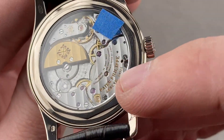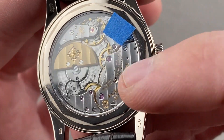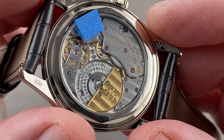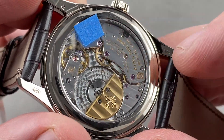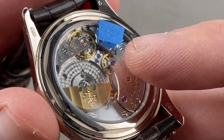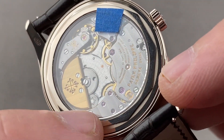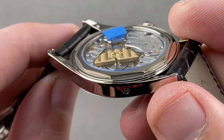This version features the Patek Philippe seal. From mid-2009 onward they would have featured the Patek Philippe seal; prior to that they would have had the Geneva hallmark. It's a 27-jewel movement, all of this 30 meters water resistant, nicely decked out in a combination of engine turning in two sizes on the base plate, Côtes de Genève across the rotor and the bridges, mirrored perlage which you can see lighting up underneath my finger, beveled edges on the bridges — the same mirrored treatment given to the jewel and screw sinks. All screw heads have been chamfered on their slot and around their circumference. Overall, it is a very handsome movement and a very handsome watch.